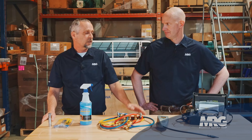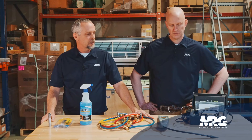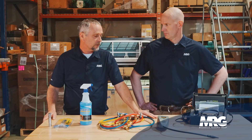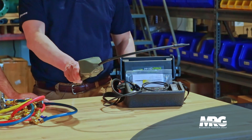This is the one we prefer using here — the Bacharach H10. We've had a lot of luck with it, especially when we saw the transition into R410A refrigerant. The wand-style would still pick it up, but we'd chase our tails a lot on small leaks. When we started using this Bacharach H10, I physically compared the two beside the same leak, and this thing was ringing out way before I ever got the wand close. That's why we've really started using this brand. The wand-style is definitely good for R22, and it'll still pick up R410A, but it just doesn't have the same sensitivity as the Bacharach.